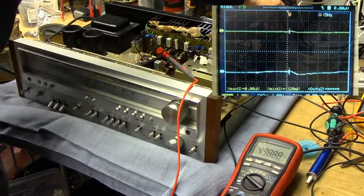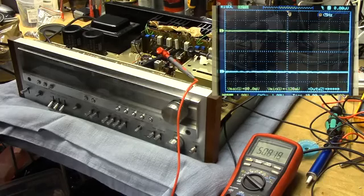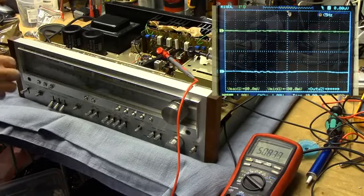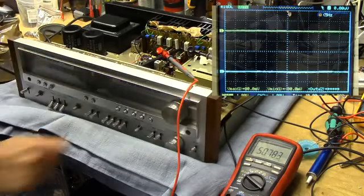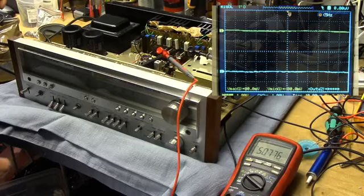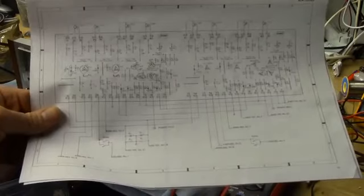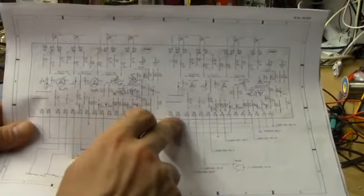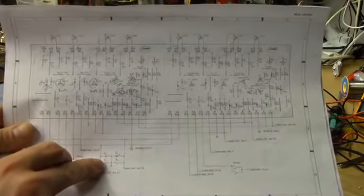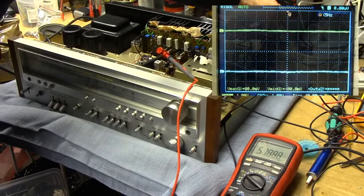We're at about, well, coming from a Variac, we're at about 120 volts AC, so that's a bit weird. The amplifier certainly shouldn't have. You know what, I might actually be measuring across both power rails right now. That's entirely feasible. I don't remember how that's hooked up. I'd better check the documentation. And yes, indeed, we are actually measuring across the power rail, which is a good thing, because we're measuring across pins 14 and 15 there, and they run off straight to the power rail, so we're getting ground just out of the case. So I'll just gingerly keep on turning this up slowly.